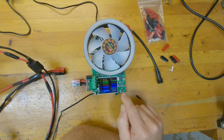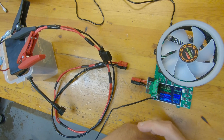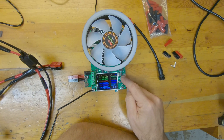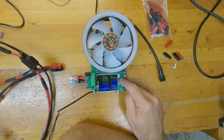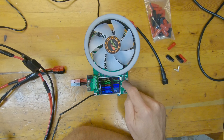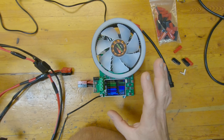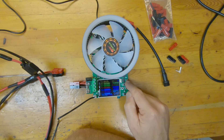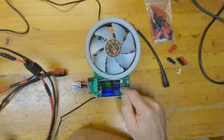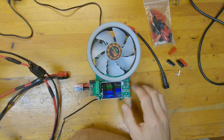Back on the main screen, you can see I'm drawing 0.25 amps — I want to do a 0.25C discharge for a proper capacity check. If I press the setup button, the cursor moves to current, and you can adjust up to 99.99 amps though it won't actually do that due to its 20-amp max, 185-watt limit. What I like about this is you can cycle through and change digits up and down fairly quickly and easily — the other unit was horrible for that.